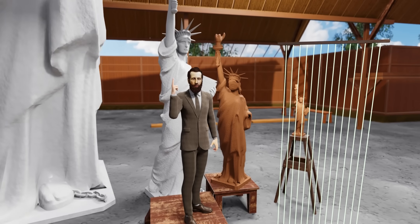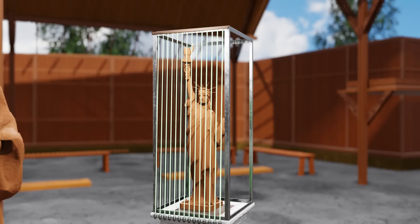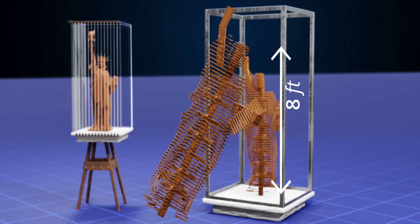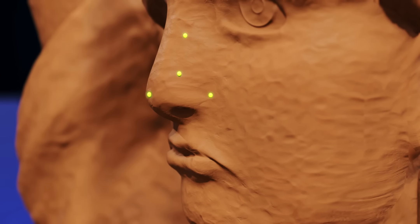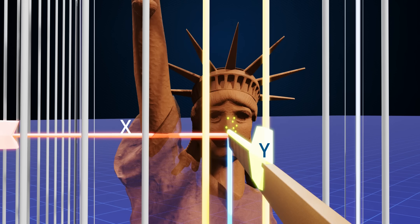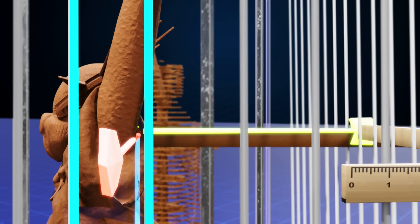Check out this scaling operation in three stages. The original clay model was first surrounded by perfectly spaced plumb lines. The second model's plumb structure was exactly two times larger, making the second model almost 8 feet tall, requiring a wooden armature for support. To scale up her nose, key points were marked. A plane was inserted to touch each point, and its Z location measured. The point on the nose lies between two plumb lines, allowing easy measurement of the X coordinate.